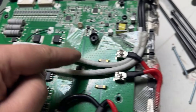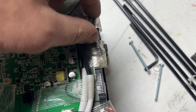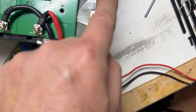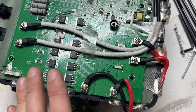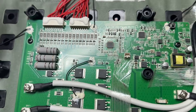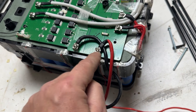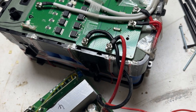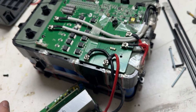I'm not sure how this is configured — battery negative going to all the negative sides of each one of those cells, and battery positive going to all of the positive sides. This circuit board I'm assuming is a type of charge controller and discharge controller. These are too thin of wires to run all that power through. Let's disconnect the two battery terminals and see if we can charge this. I've got a universal charger here — it's a 50-volt charger, so I'm not sure what voltage this is. We could just smoke this whole thing.